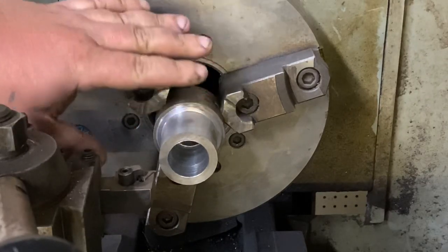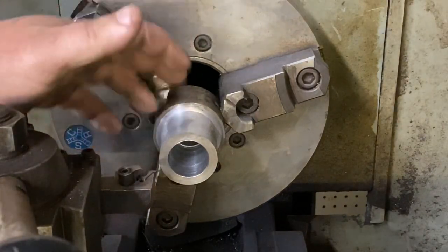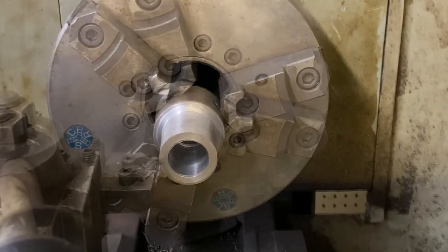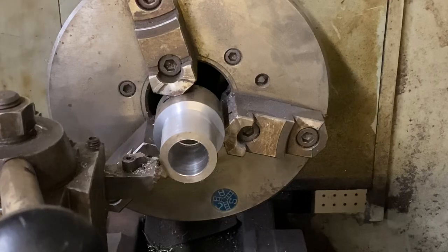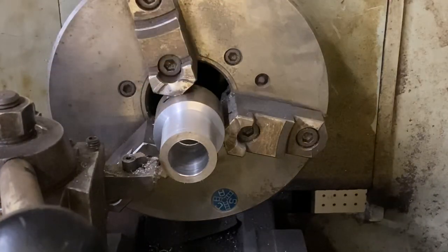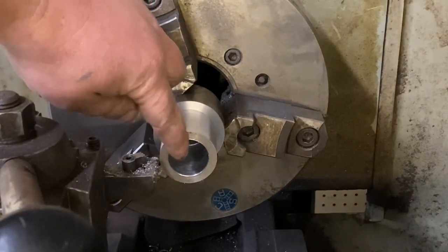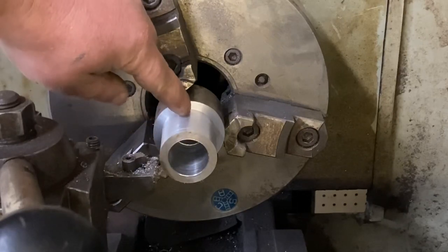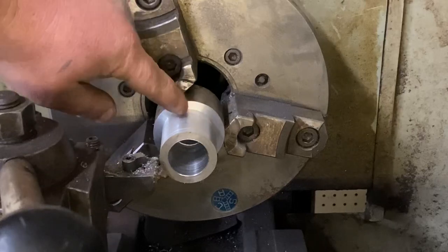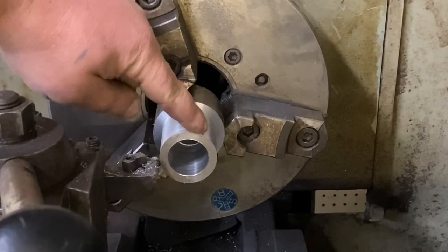We're gonna get this done. He's going through the machine because it's the off season, to see how this looks once it's in there. So I'll get the lathe going and I'll bring you back. Okay, actually I misspoke in the last part. I'm gonna get the length set and then go to the outside. So I'm gonna clean this up here, then measure off, get my indicator set up, and we'll cut this face down to 1 3/4".